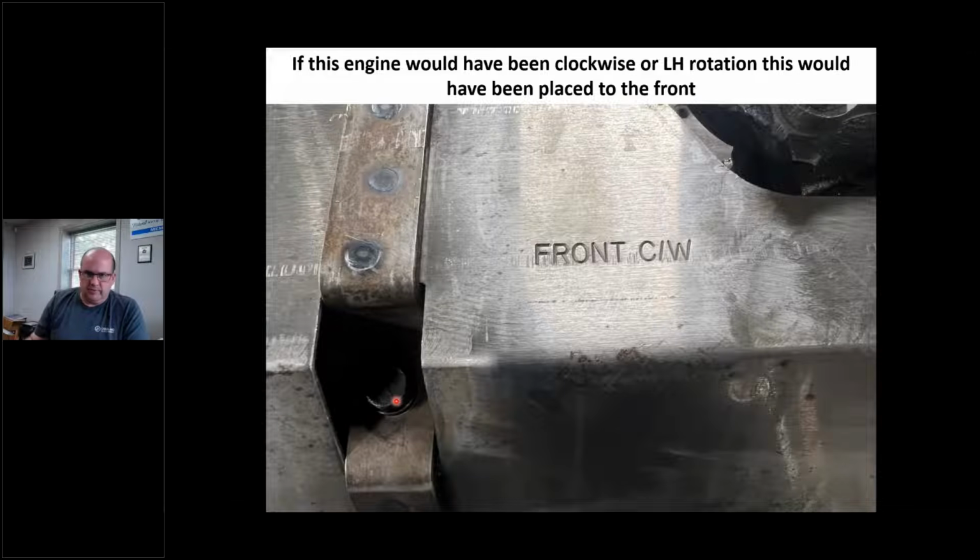There are holes in the main caps and it bolts in there. The older engines, late 60s, early 70s, I didn't see a windage tray. The oil pans were the same. And by the way, that cast aluminum oil pan is only for an inboard engine. Chrysler, for many years, made their own Dana outdrive, the Dana 90. That used a car oil pan, a stamped steel pan, identical to a '78 D150 truck or whatever. So the cast aluminum pan is what has the windage tray. Just to give you a for instance. I know I didn't have that on the slide, it's just something I thought of.